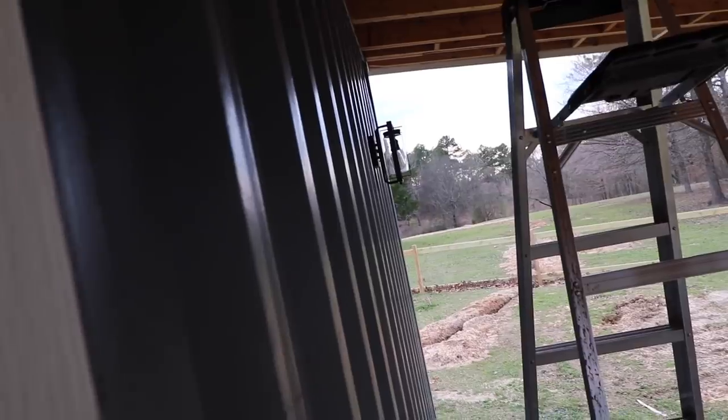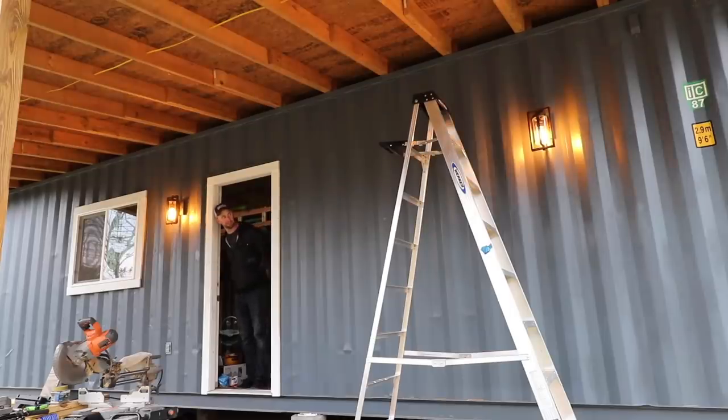One light. Well, we don't have the second light for some reason. I'm assuming since I had the light dangling, just one of the connections came loose. So we kill the power and check it out. All right, I'm pretty sure I figured out what it was. It was just the neutral wire on the second light. It came loose. Woo! Look at that. Looks awesome.